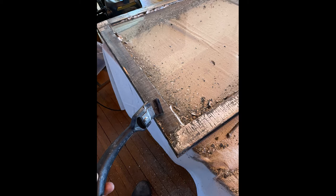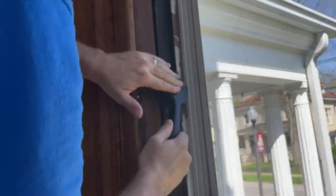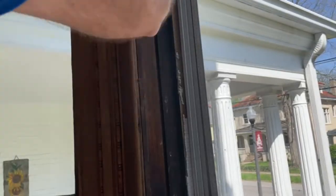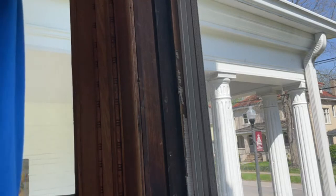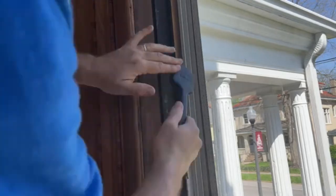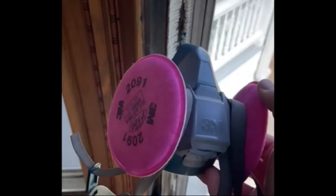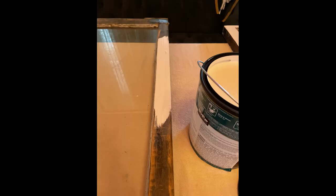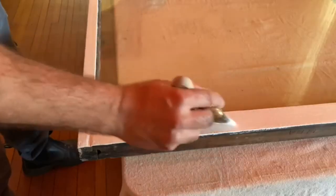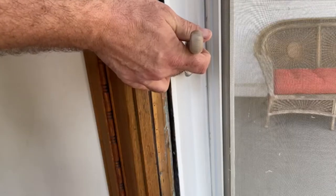What I had to do was resort to pure muscle. Using this paint scraper, I was able to do one window in about six minutes. You can see it worked just fine on the window frames as well — really just a little bit of muscle and some tolerance for a mess. And of course, because it's most likely lead paint, I always wear protection and I do recommend that.